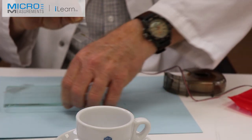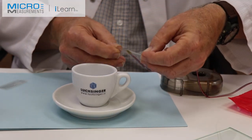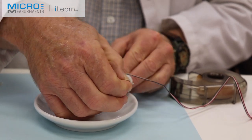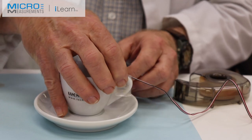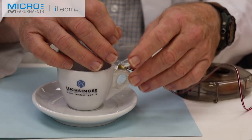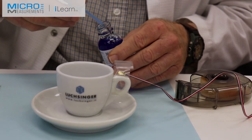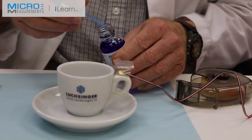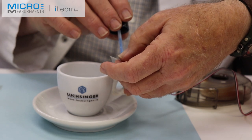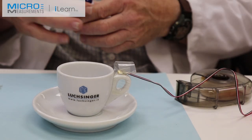I'm going to pull the gauge off and bring the cup handle into position. This is really tricky business because at this point you're very susceptible to damage of the gauge when it's unbonded. I'm going to position it where I want it to land — this is the final position of the gauge. I'll expose the bonding surface, taking the Catalyst C on the inside of the neck of the bottle, taking about eight or ten swipes to get rid of most of the Catalyst C — we need just a very tiny amount. Then I'm going to use the brush to put a single wipe across the back of the gauge to apply the Catalyst C, and now wait one full 60-second minute.